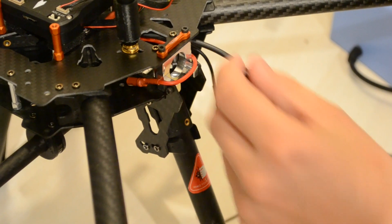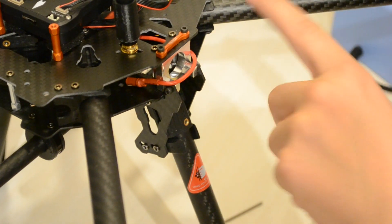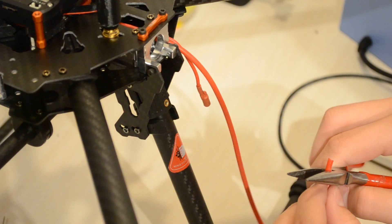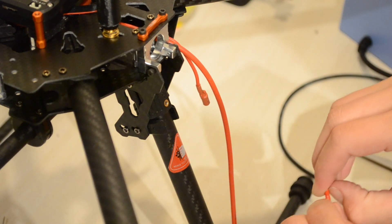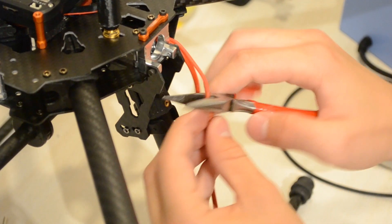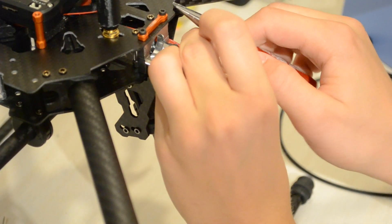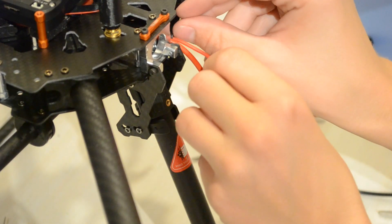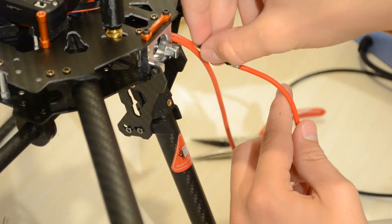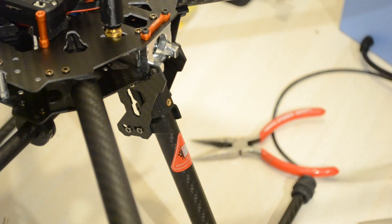Go ahead and pull the wire out from the arm so you get the soldering joint to be inside the arm. Do the same thing with the red wire: chop off the isolation after you've fed the wire through the arm and it's come out the side. Chop off the connector, remove the isolation here as well, put on the heat shrink, solder, and then pull the wire back into the arm.